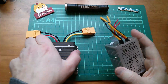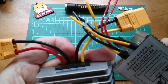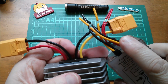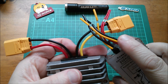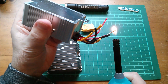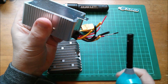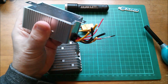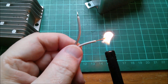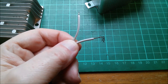My first concern is the wires - they do look quite a bit thinner than the wires on the more expensive device which I know can handle at least 25 amps. I'll get a lighter because people say watch out for copper-coated aluminium. Let's heat this up - aluminium generally just melts and collapses. That's not melting and collapsing, so that does look like tinned copper. Just for comparison, this is copper-coated aluminium wire - it just falls down and goes limp. You can tell the difference.